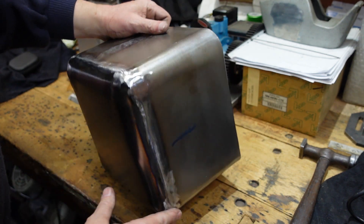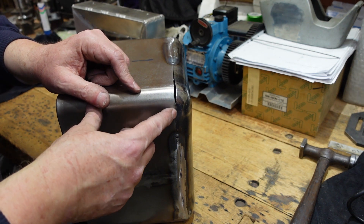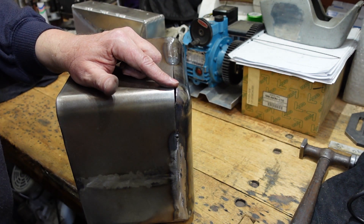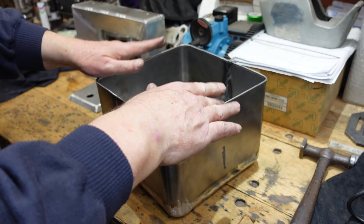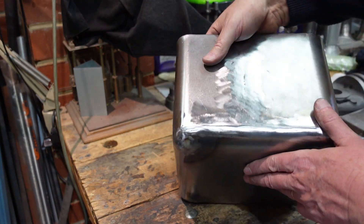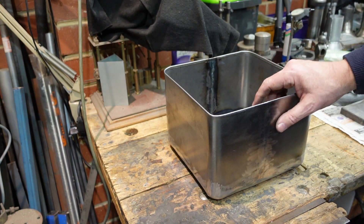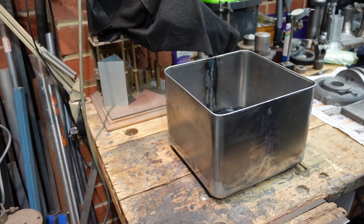I've got almost three sides done. I've got a problem from the dolly work — I think this corner needs to be trimmed back, so I'll get the Dremel out and hopefully finish off this corner. Then basically I'll be done and have a box that's around 230 by 230 by about 220 high. Here it is finished — or almost finished, needs a bit of paint. I've got the radius bending in there and the spherical corners. It's only going to be a storage box but it was an interesting thing to make and an interesting technique to explore. Thanks for watching.